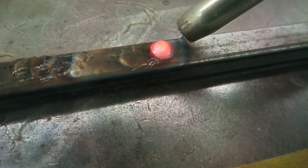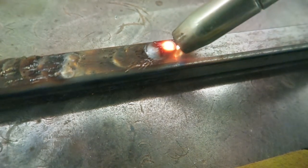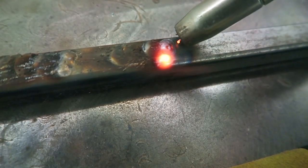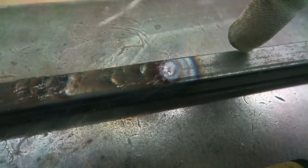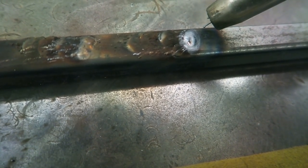MIG welding, as you can see, it's pretty good as well on MIG welding. It does have this characteristic that most welding masks have, and that is if you do a long bead of MIG weld and you stop welding, the arc disappears, the mask thinks, right, they've stopped welding, I'll turn the mask off. They turn the mask off, then I think what's happening is it picks up the glow of the bead and shuts the mask down again to protect your eyes. As I said, this is very characteristic of most masks that I've used.